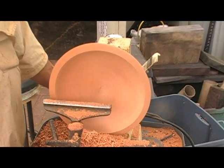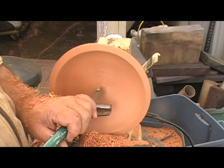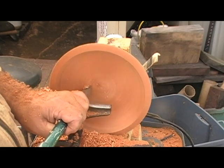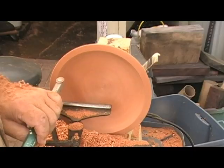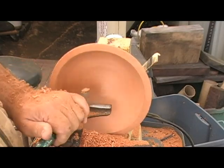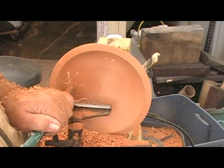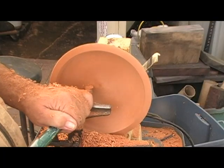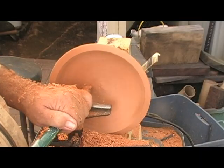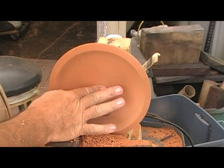Make a few passes and check the measurements. I'm within about a sixteenth of an inch. I want to roll the tool over on its shoulder to make lighter scrapes or slices. I have to keep the tool rest clean and flat or I'll read that — a bump here is a bump there. Same thing going to that center: if you can detect it at all, you have to work on it.